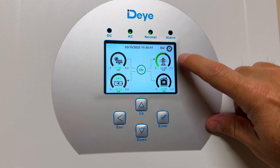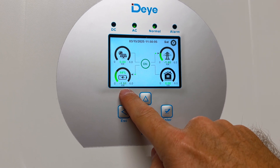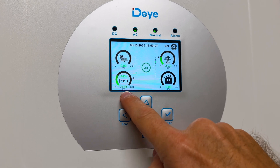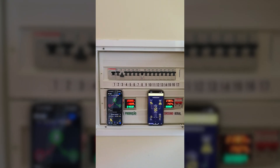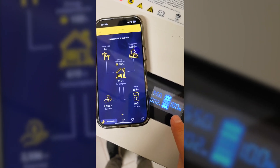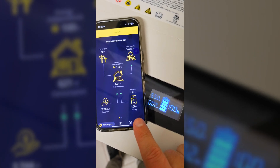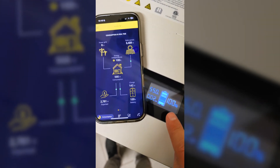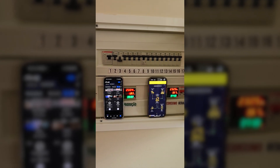If I had them measuring the general flow, I would never know if the value was positive or negative. With the battery in place, all generated energy is now consumed by the inverter to charge the battery, so the values will stay equal unless the battery is already at 100% capacity. And during the night, if I'm drawing power from the battery to power the house, it will show zero, because there's no consumption from the grid and obviously no solar production.